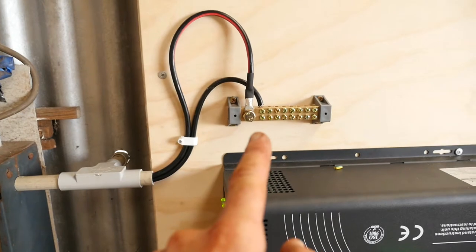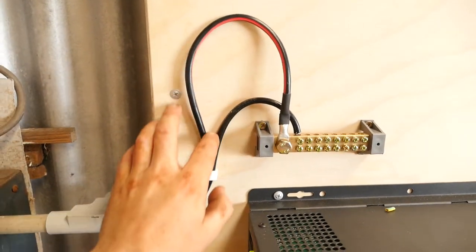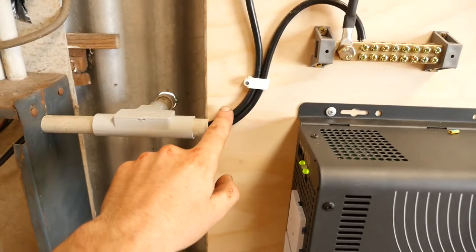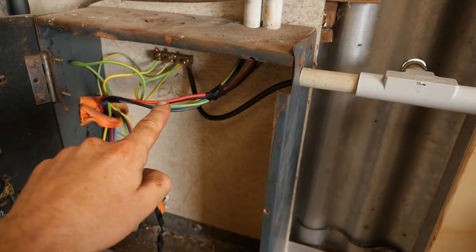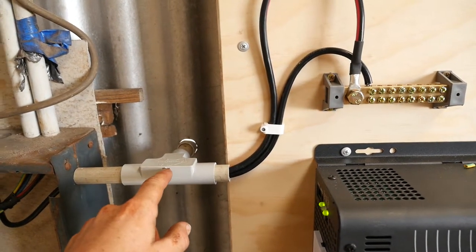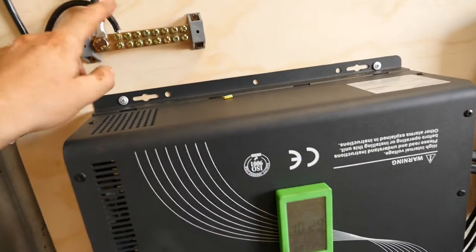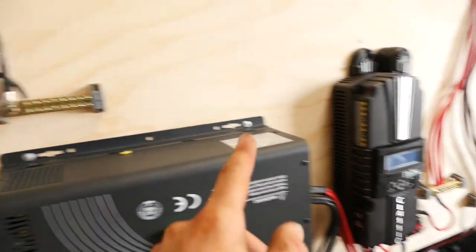I've got the T all done and installed the bus bar. I'm going to get some green tape — the earth-coloured tape. This big loop here goes to the earth ground stake, through the T and then out the wall. The other one connects from the bus bar through the T into the fuse box and attaches to the earth there. I actually installed a thicker gauge wire — this is 8 AWG down to the earth stake, because the connection points in the charge controller and inverter actually require this gauge wire. Now I've just got to connect from the bus bar to the inverter and charge controller, but I'll do that later.